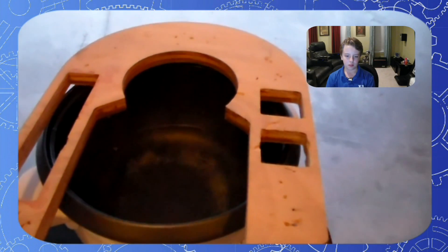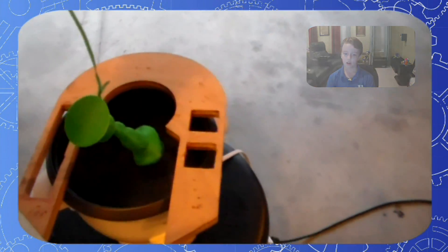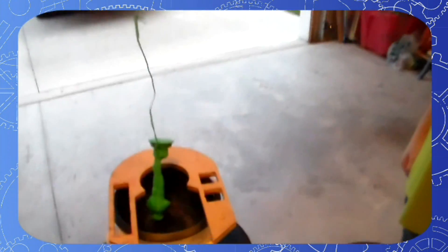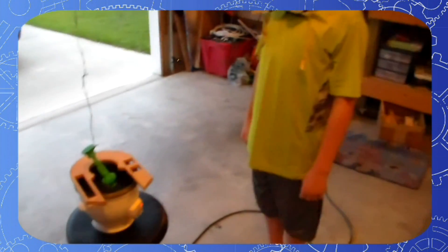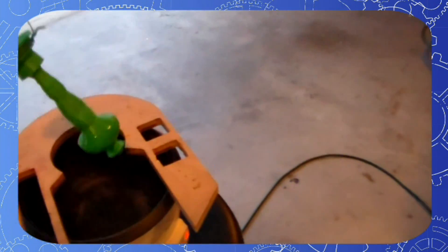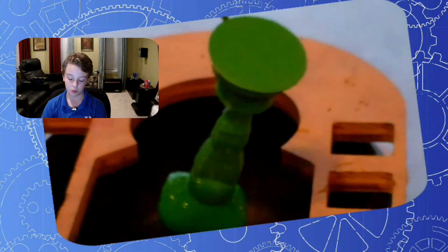There are many ways to expose the part to acetone vapor. We made our own rig to do it — it's just a rice cooker. We boiled the acetone and put the part into the path of the vapor. We don't want it to heat the plastic; just let the vapor come in contact with the surface. Heating the plastic would result in melting and causing it to sag, so we keep the part far enough away that this won't happen.